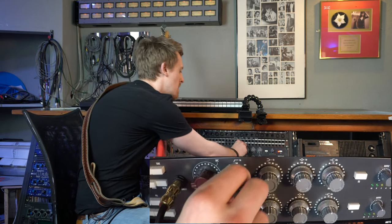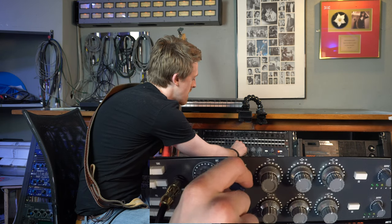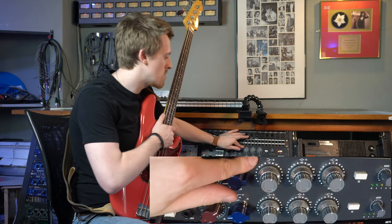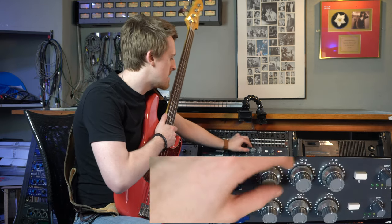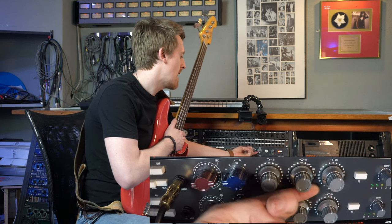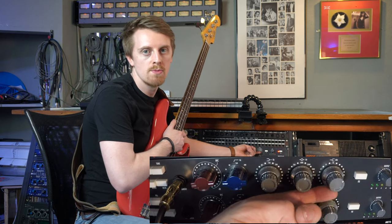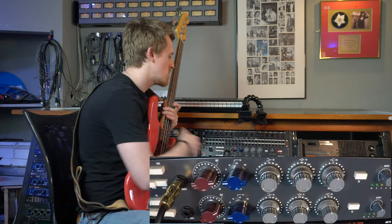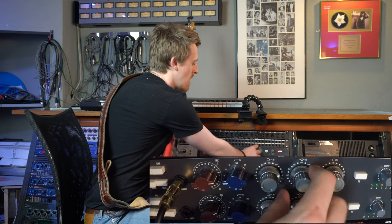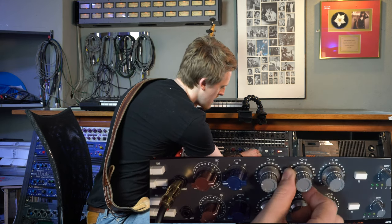In this instance we don't need most of the range because the instrument level stuff is all in the top last little section. There's an off position, and after that we're into the highest levels of gain. Then we have a high pass filter - that'll cut out any excessive low end - so we're talking 50, 80, 160, and 300 Hz. Then we have a Neve EQ: a shelving EQ on the bottom and a shelving EQ on the top, with different frequencies selectable. The bottom of the ring selects the different frequencies.